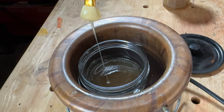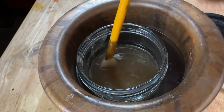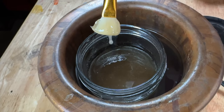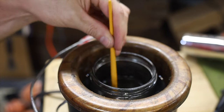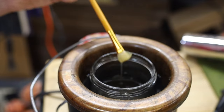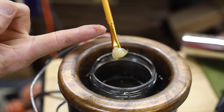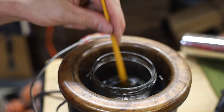There are instances where I'd want a slightly thicker consistency, and the working time and strength of the glue aren't particularly affected if you go a little outside that consistency. It will be a little bit thicker in an hour because the 50% water in the mix will evaporate slowly. When it gets to a point where it's dripping in blobs or very slowly, you've got to add more water.